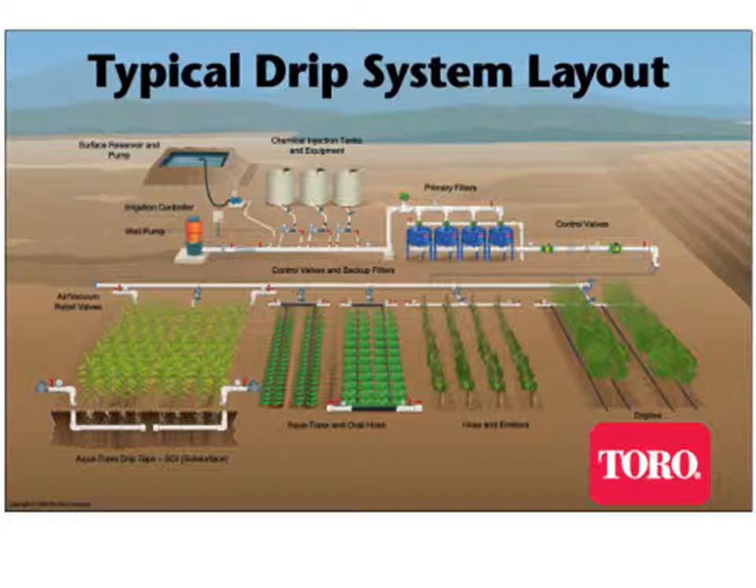In Illinois, it is far more common to see vegetables irrigated than fruit, although we do see both. In the vegetable system, which is the most common for irrigation, drip or sometimes called trickle irrigation systems are the most common for vegetable production. These systems, very similar to microsprinklers, only apply small volumes of water to the area that is immediately crop adjacent. They are low pressure systems operating at less than 15 PSI and afford growers the ability to use smaller pumps and pipes when compared to overhead systems.